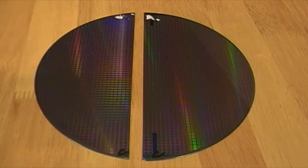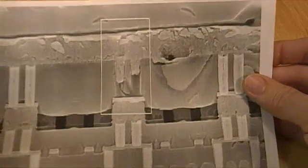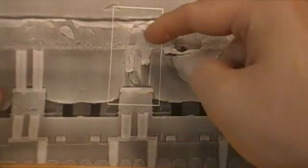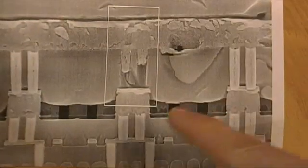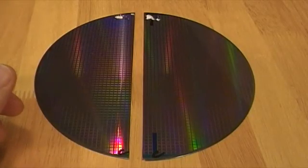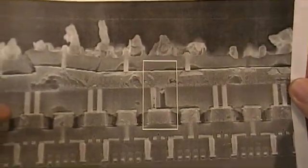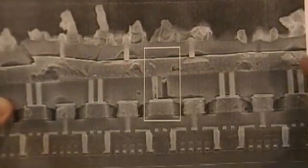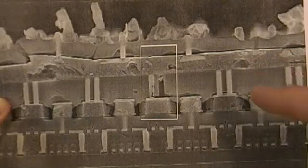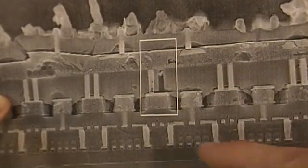This wafer was cut apart for a scanning electron microscope cross-section to find out just what problems they could see. For instance, the metal plugs aren't actually connecting from one metal layer up top down to the other metal layer. Another SEM picture from the lab shows a metal line up here, some tungsten plugs going down to other metal lines — here's the one in question — and eventually the substrate of the wafer where the different transistors are.